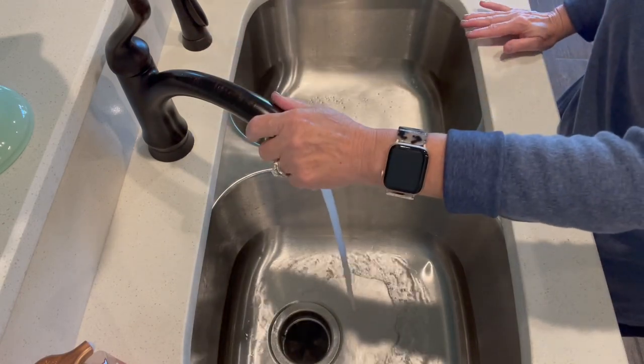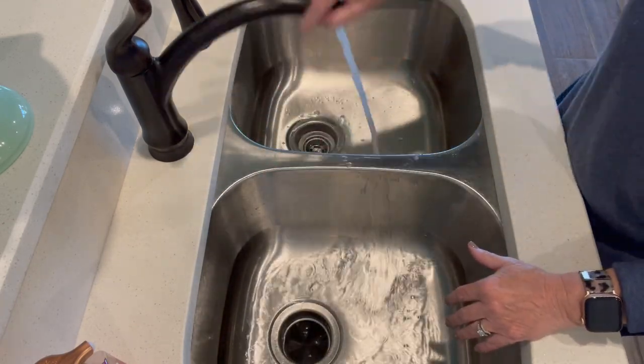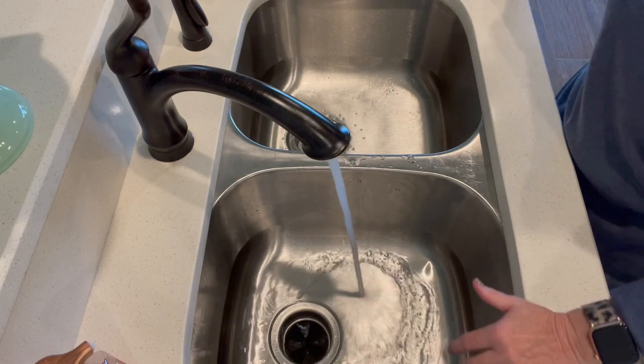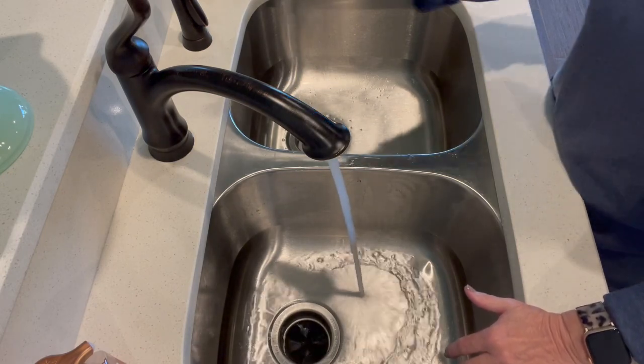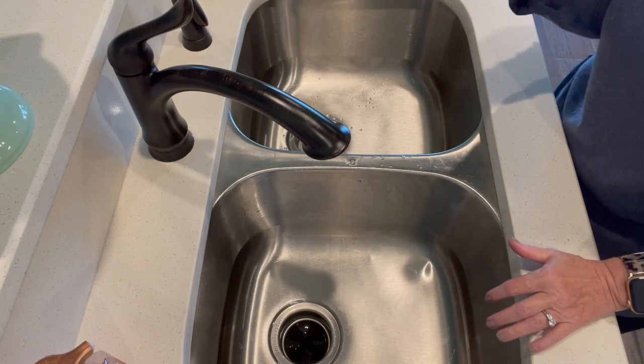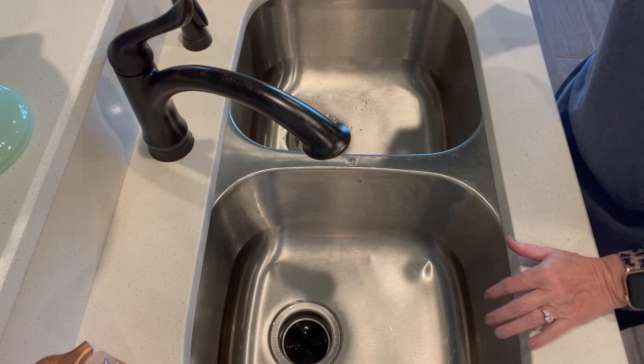I know that in my setup it goes from the disposal side over to the other side and then down the pipe. So I let the water run mostly on the disposal side and then at the very end I'll just move it over and let it run there for about a minute. The other thing that I do is go into my bathrooms and squirt just a tiny bit of Dawn in each bathtub drain and run that through for about a minute with hot water also. I do that at the beginning of every month and it kind of helps keep that grease minimalized in the pipe so it doesn't solidify and clog up your grinder pump and cause all kinds of damage.